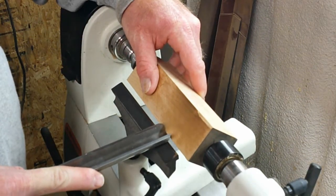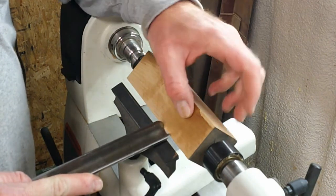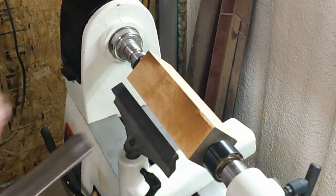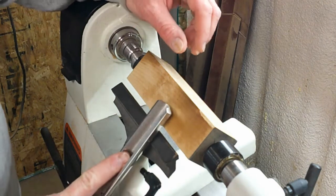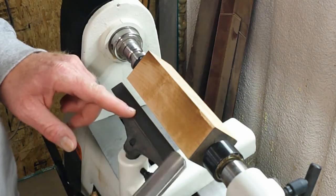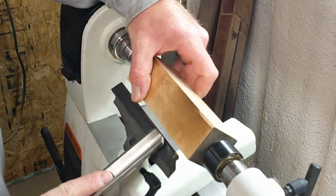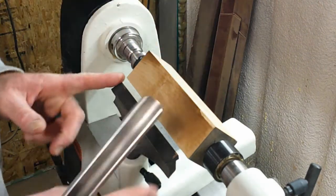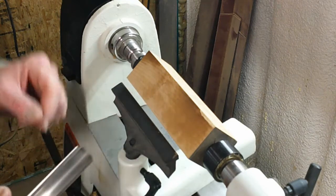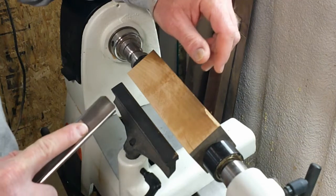Tool rest height: if we look at the bottom of our flute, we want it to be at center. When we start doing a cut, we anchor our tool on the tool rest. We don't want to slide off either edge — it'll smash fingers. So we're going to stay within this boundary line, an imaginary fence of our tool rest, so to call it.